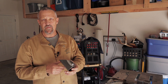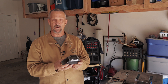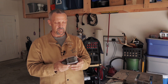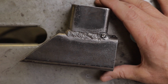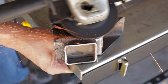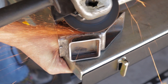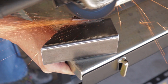In my previous video I was welding square tubing using the Juba ZX7-200 stick welder and welded a couple of pieces of two-inch square tubing together. If you watched that video, you saw that I had one section that had a lot of undercut, so I ground that down and tried to make it so I could lay another weld in there. I'm going to use 6013 rods and see if I can fill that in.